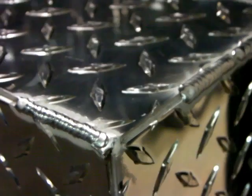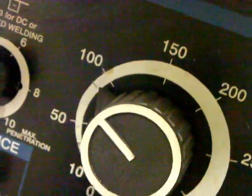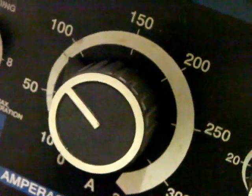One thing also is you don't always want to go up to a huge electrode. A lot of people don't have any 5/32 electrodes in their box, and one-eighth inch — sometimes you're pushing the limit. Well, you add helium, less amperage, less heat on the electrode. Sometimes you can use one size smaller electrode than you could without it.